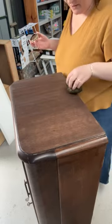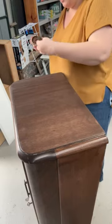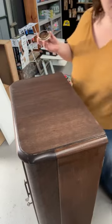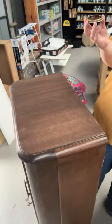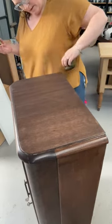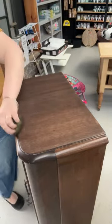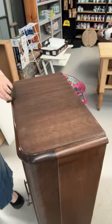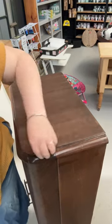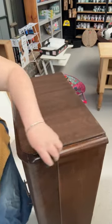This is the only other branded stain I've got. I've only got the Pure Eco stains, but every now and then I just want this tiny little patch of red. If I'm doing a lot of orange pine pieces that I'm selling as is, sometimes it's nice to have this on hand as well. I'm just going to wipe that over those edges as well — same as the stain and glaze — just to make sure it's all pulled together nicely. I don't want to see any of that really light-coloured timber coming through.